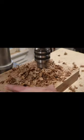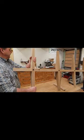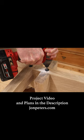Adding a dowel under a lap joint is a great way to add additional strength to the joint, because screw threads have more holding power in long grain than in end grain. In this case, the 5-inch lag will thread into the long grain of the dowel and pull the trestle tight against the leg, creating a very strong glue joint that's reinforced by the lag bolt.